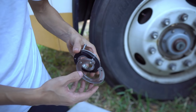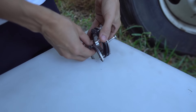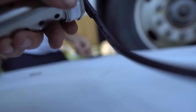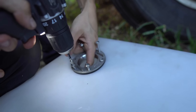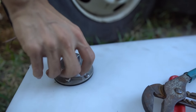What you do is thread one screw on so you don't lose the C in the tank, then slip it in there and get it down. Sadly I cross-threaded one of these screws but the clamp is in there — I don't think it's going to leak. Now all you have to do is tighten this sensor on with Teflon tape. We'll get 12 volt power to this and be able to see when the tank is empty or full from inside the rig.